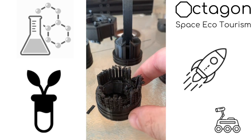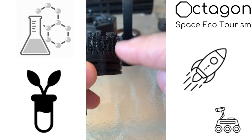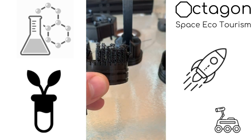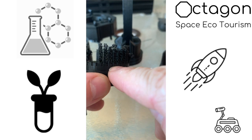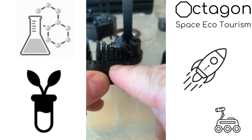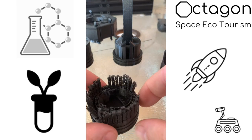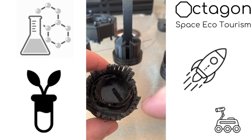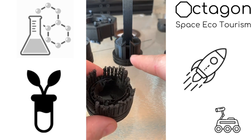So you could see exactly where this started to happen. When I was printing down over here, it was nice long runs, the filament was running through, and the gears weren't going back and forth over the same thing. Then it did it for whatever this rise is, and by the time it got to this, it went to shit. Again, this is thicker than that. I tried tree view support, it didn't quite work out. So at that point in time, I just had to scrap the approach and I moved to this design.